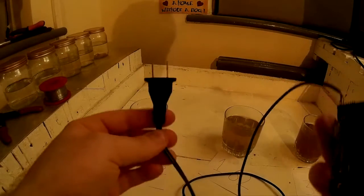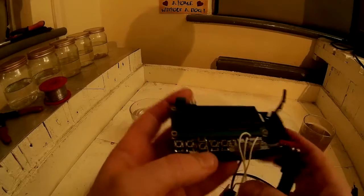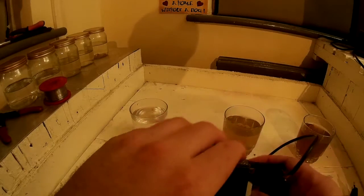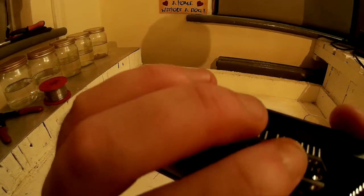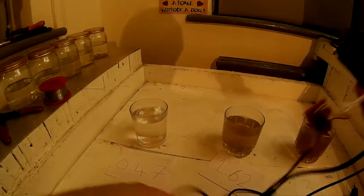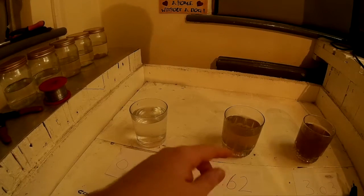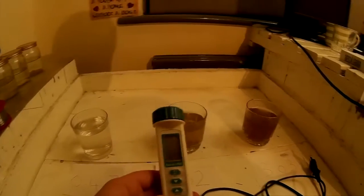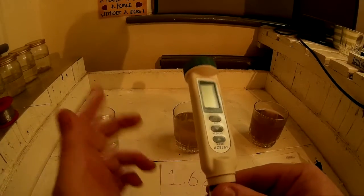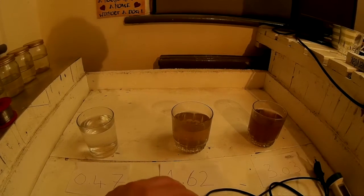Because if these were soldered out, we wouldn't quickly be able to take them out and replace them. The LCD shield is just a generic LCD shield with buttons — you need the one with buttons. It just pops off and on like that. Very easy and very cheap — about three dollars on eBay. These values are calculated using a commercial TDS meter. It's not been calibrated in a while but it gives a good indication of what values we should expect.